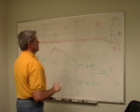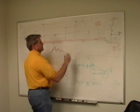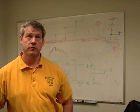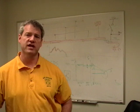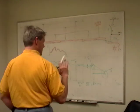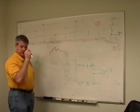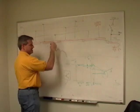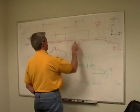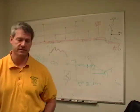That's cool. One of the other problems is, gee, these gates aren't transparent. I mean, light gets through them, but if you look at video from a really old imager, an old video camera, you'll notice it looks kind of orange. Not because my shirt really is orange and yellow, but they have an orange tint, and that is because the polysilicon is like a red filter, or kind of a filter. It has a band pass, and certain things don't get in. So one of the things we can do is change the material of the gates from polysilicon to something like indium tin oxide.